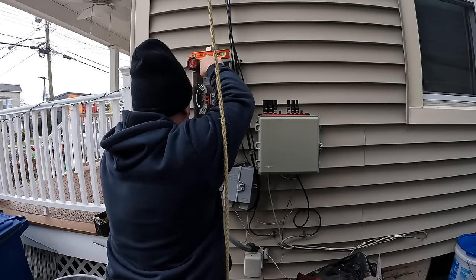The National Electric Code recognizes service entrance cable as a wiring method for electrical services. It may not be used all across the country, as I've said before, but here in New Jersey we use it a lot and throughout the Northeast. The rules requiring straps and support for service entrance cable can be found in Article 338, Section 30.